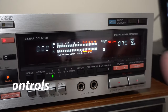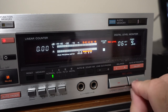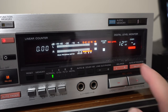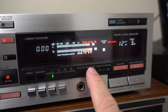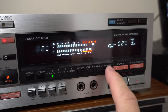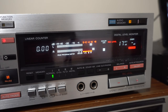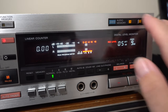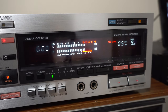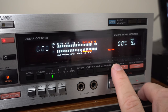Anyway, enough about repairs — let's get back to features and talk about digital level controls. Everything here is digital. You have the main record level with two large buttons, an auto attenuator which overrides that level, and the rightmost digit monitors how far you are over 0 dB as you make a recording. You have a Dolby NR toggle, line out and phones level, and all those settings can be written into audio memory slots A or B — you adjust how you want and hit write.